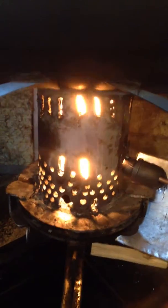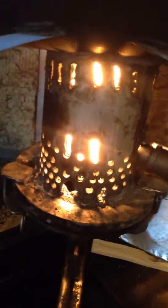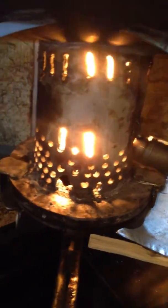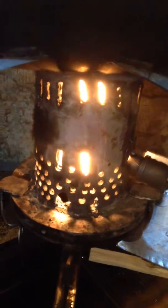I relined the inside of my steel brake drum with stainless steel. It's been running for 30 minutes now and it's maintaining the heat. It did take me a little bit to get enough of the stainless steel inside the fire pot up to temperature to regenerate the heat, but it seems to be doing quite well on its own right now.